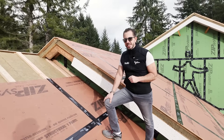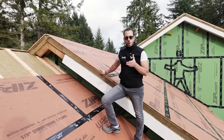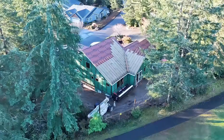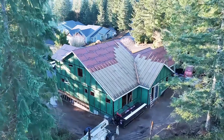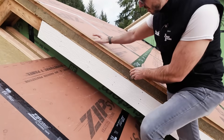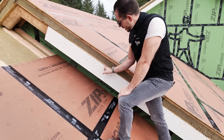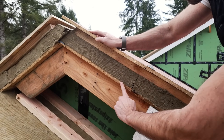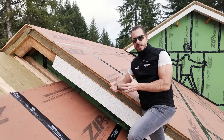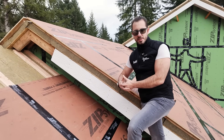That's 'in real life' for my 14-year-old son. So what this is, is an over-vented roof assembly that's also insulated. If you come up here, I'll show you some of these layers. This is a nice little section — rather than a section drawing, it's actually a section that we're able to see. This here is the actual roof sheathing, and that is basically going to act to hold together all of the roof rafters — that is the structural system.